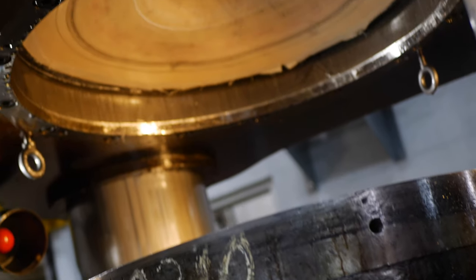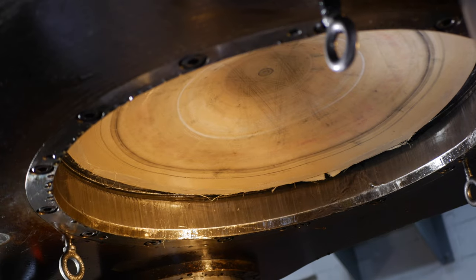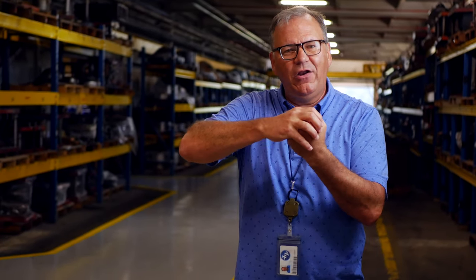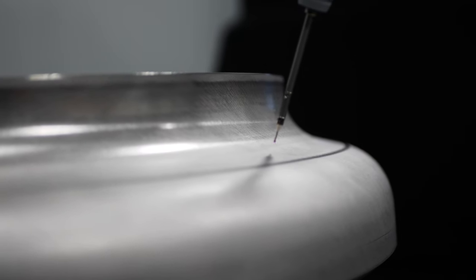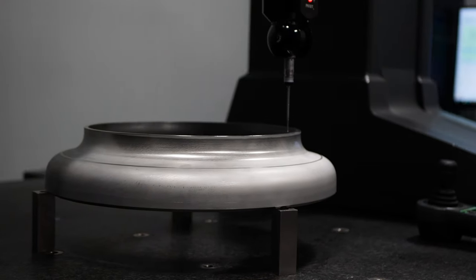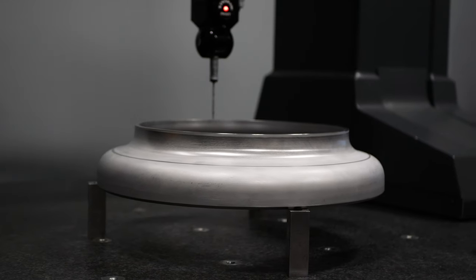We have a rubber diaphragm pushing oil that protects the top side of the part, pushing down while the punch drives up, so you're not getting that metal-on-metal grinding. If you look at a stamping part, you'll see scratch marks going down the side. For basic commercial products — say, a lawnmower part — that's okay. But if you're making something that needs to be visually attractive, having that rubber on the outside during the forming process gives you a much nicer finish.